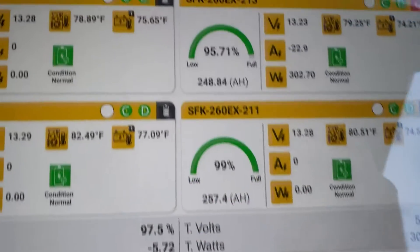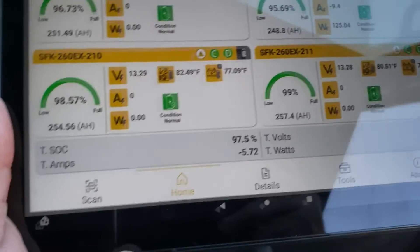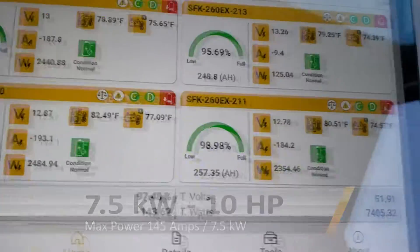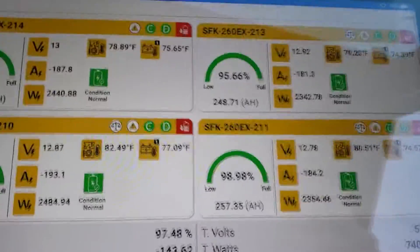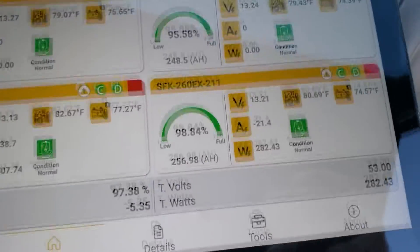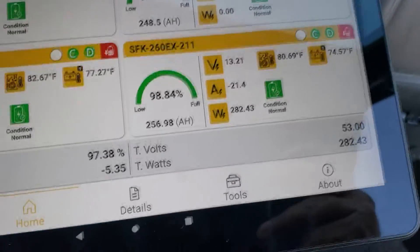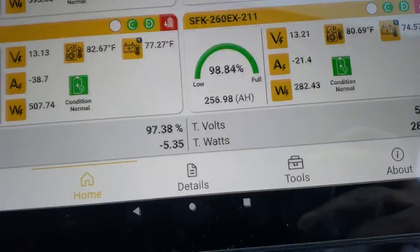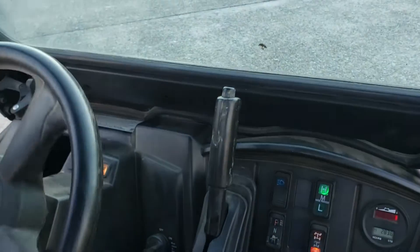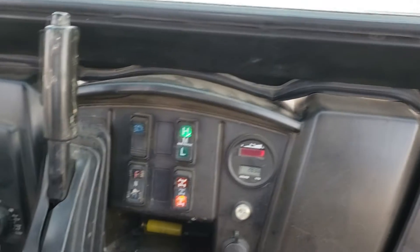Go to full power — high power. Let's see how much amps we're drawing at high power. 150 amps. So you're within the limit. Does it feel like normal? It's definitely normal. You're only drawing 140 amps. You could have actually gotten away with the 300-amp version, but this is probably cheaper — the ones with the 150-amp BMS. Maybe, but 200 amps is probably better because you've got a little bit of headroom.